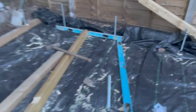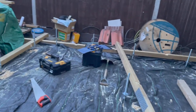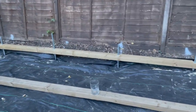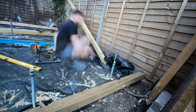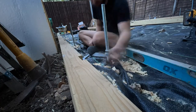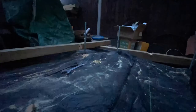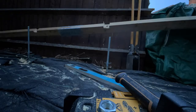The timbers sit on top of the washers. I've drilled 22mm holes — the rods are M20, so 22mm gives clearance — all the way around the perimeter and through the middle. Make sure you put in your weed membrane beforehand, otherwise it's a nightmare to fit it under the joists afterwards. I'm winding the nuts down using a spirit level, starting from the highest point and leveling all the way around, then locking them off. It's getting dark — this was around 9 or 10 o'clock at night in summer.